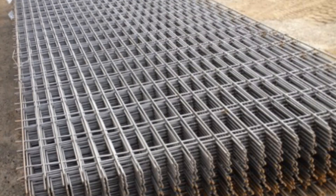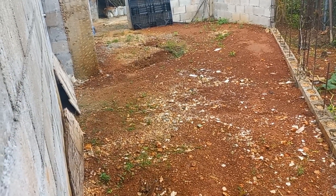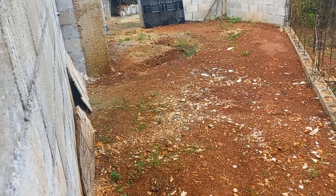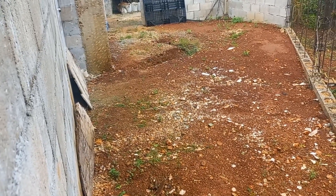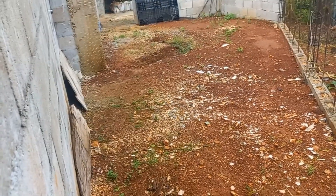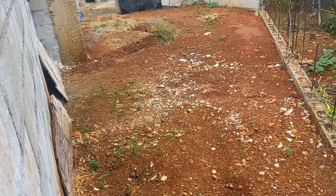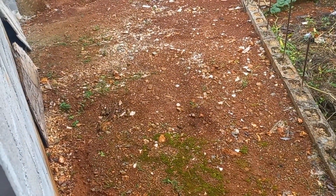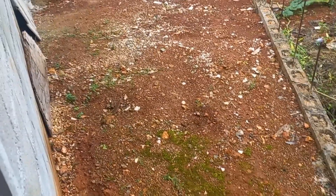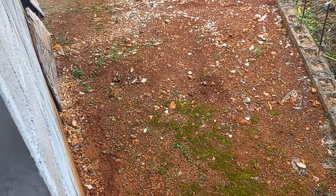As you can see on your screen, there's BRC wire — some people use rebar — running throughout the length and width of the floor. They don't have to be that close together, but they will prevent the floor from sinking or cracking. Especially if you have trees around, the roots will go under your floor and cause cracks even in your walls.